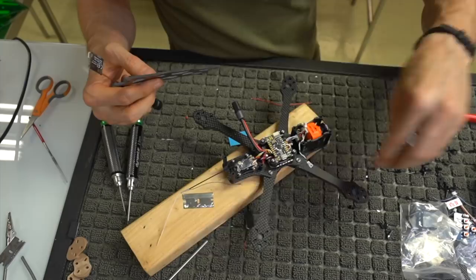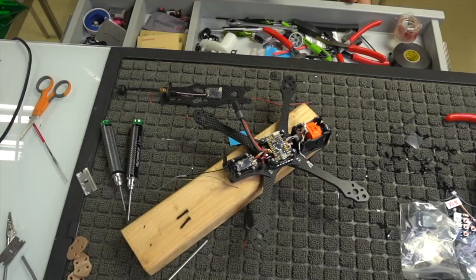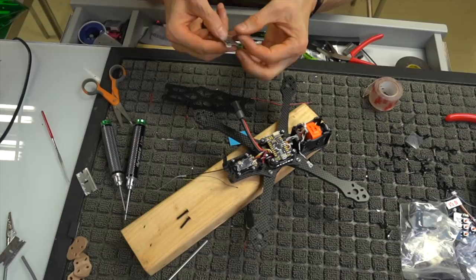We're going to take our VTX and we're going to mount it with double-sided sticky tape to the top plate, basically right behind where the camera stuff is. All right, so let me get some double-sided sticky tape. I thought I had a piece out earlier. I did, but I'll just cut some more. You don't want to use a crazy amount of double-sided sticky tape. It's just enough. I'd probably put some on the front